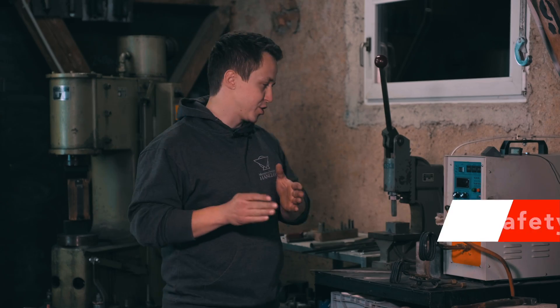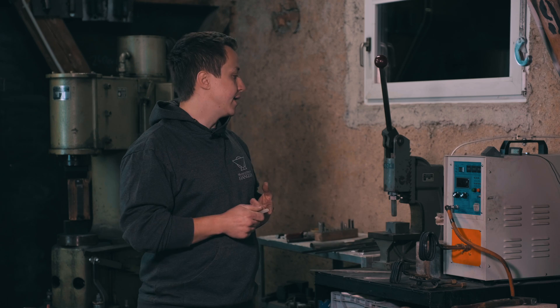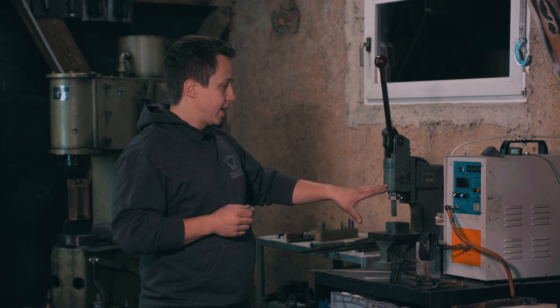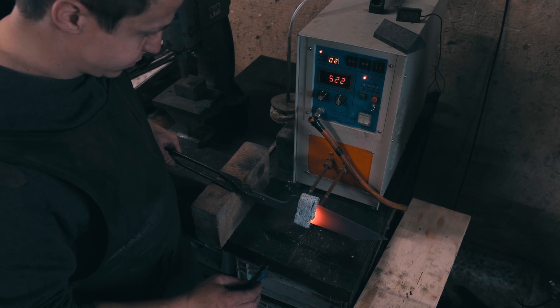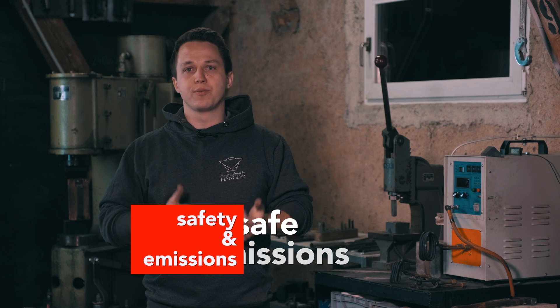When we talk about safety and emissions, the induction heater is a very safe medium for heat treating. Salt baths can be very dangerous as heat treating media, and even a gas forge has emissions — it's not safe to use in a basement, and you have off-gassing to deal with. With an induction heater, only the knife gets hot, nothing else. You put it in a quenching medium and that's it. Very safe, low emissions — definitely a strong point for the induction heater.